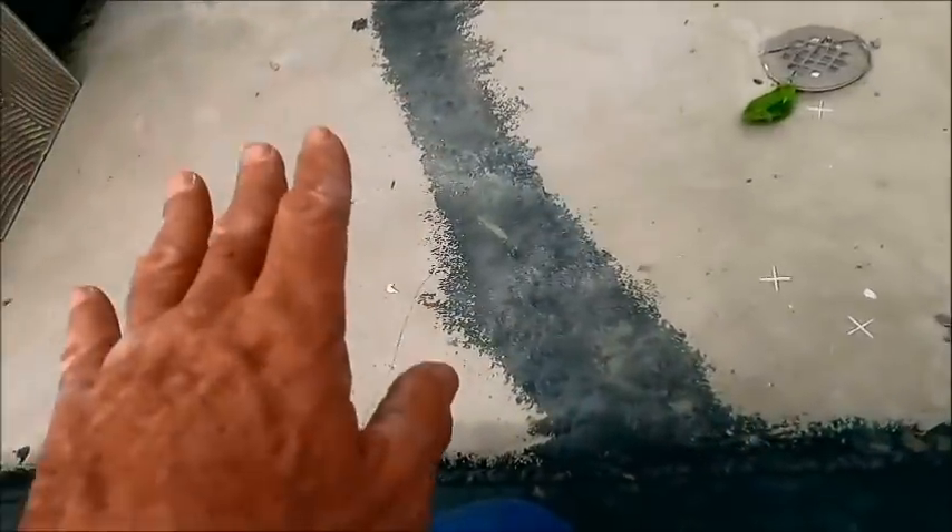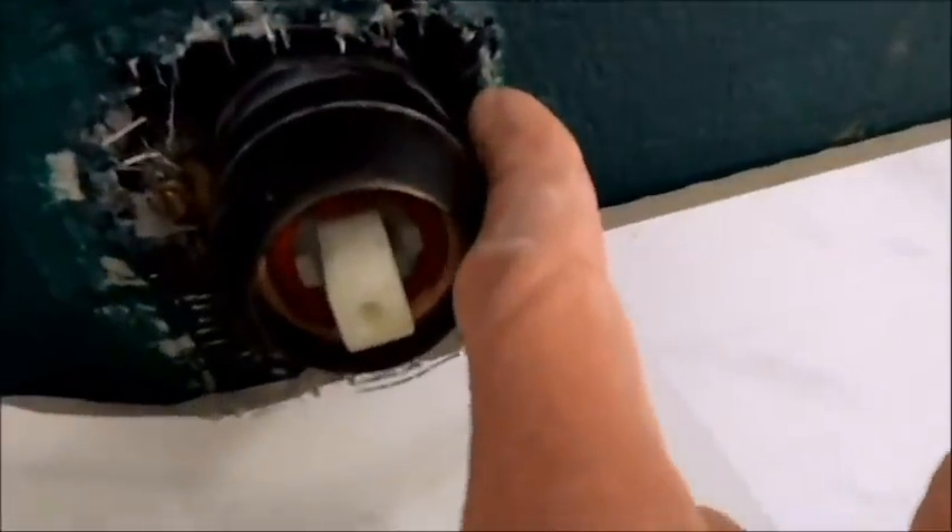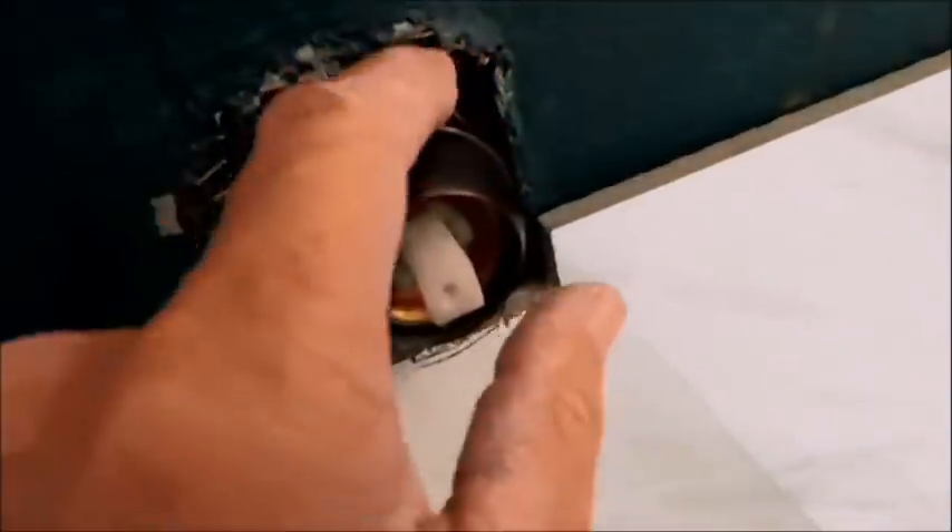I just noticed this crack, and more than likely that's why Aqua Defense got put here - because this pan started cracking, which there's no reason for. They should have done their floor tile first before setting the wall tile. There's a hump over there and dips over here - they just slapped it together. Then up at the shower valve area, look how they wrapped it. I forgot the brand name but they claim they got it at Home Depot, and it has stops on it which I love - but how do you access the stops? I can barely access the hot side and can't access the right side at all.